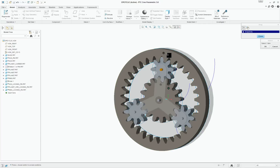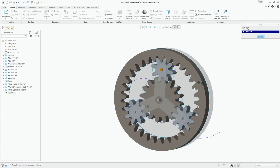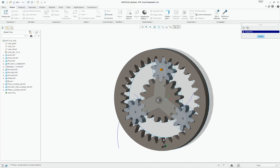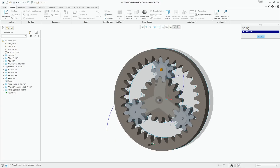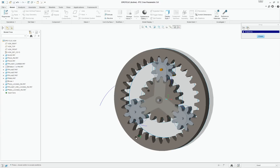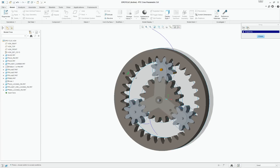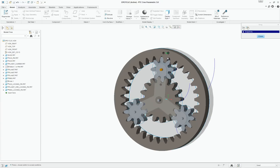Let's try again with the ring gear. The ring gear has completed half a rotation in clockwise direction, and the sun gear has rotated one time in anti-clockwise direction. Now it is two times in anti-clockwise direction. For every one rotation of the ring gear, the sun gear rotates two times in the opposite direction.